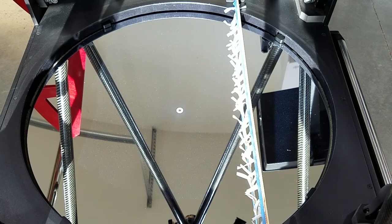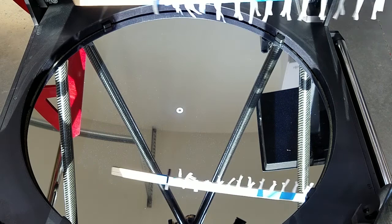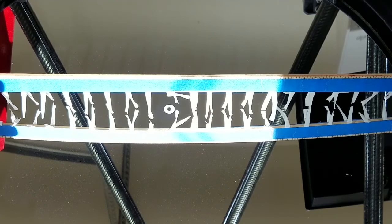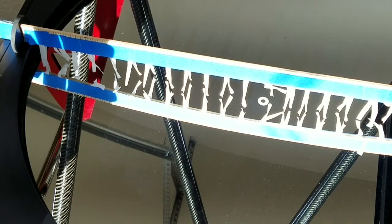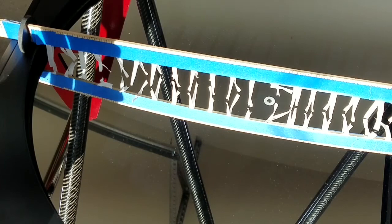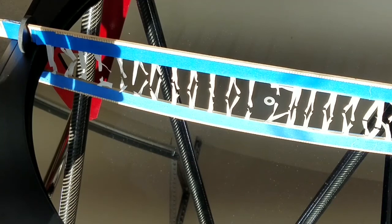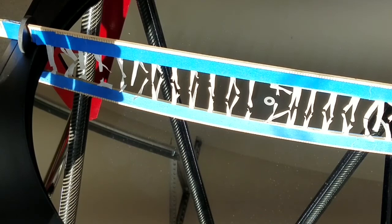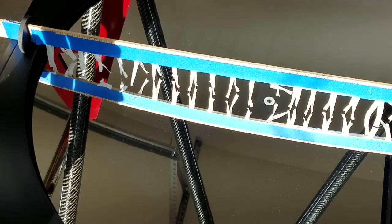The mirror's center mark was receiving good flow, exhibiting uniform coverage with no stagnant or dead areas. The smoke test demonstrated that a smooth, fast laminar flow begins at the edge and gradually transitions into a random, slower central region. This can be ascertained by studying the direction of the tails — small, fast movements bending inwards near the edge, giving way to slower, more random oscillations in the center.